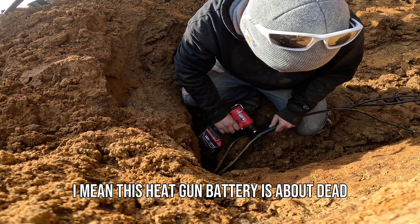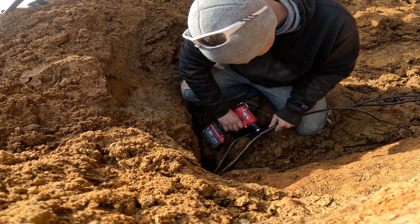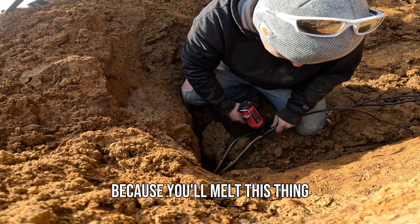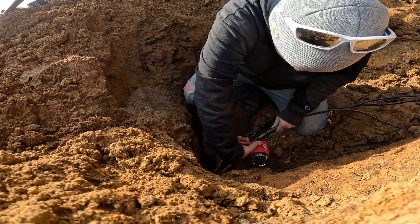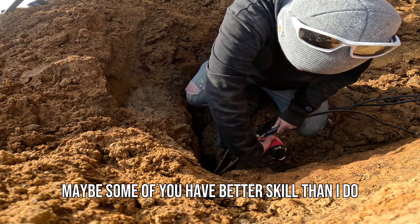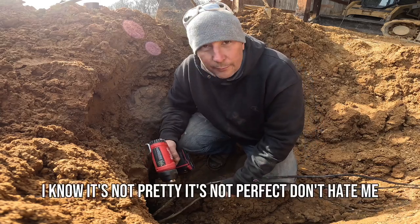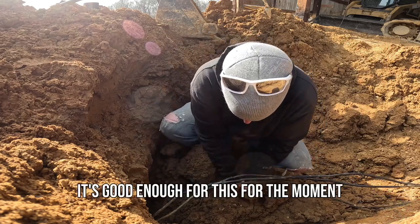Now we're going to get our heat gun, which is painfully slow. We're just going to shrink wrap this tube on for weatherproofing purposes — it actually has a glue inside it that once we heat it up will stick to the outer casing. That's why I was cleaning it off. It'll keep any dirt or water from getting in, and I also have some special tape to put over top of it too. You don't want to use open flame because you'll melt it. Small ones you can get away with a flame, but the big ones — and like that, we got it. I know it's not pretty, it's not perfect, don't hate me.